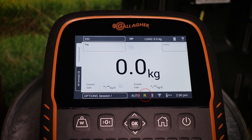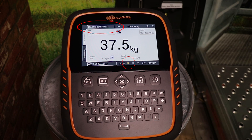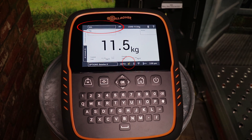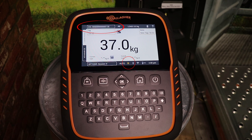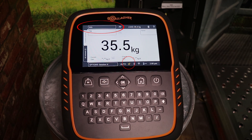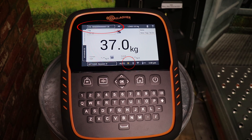This is the smart weighing mode in action. As soon as a weight is registered by the load bars, the weigh scale will turn the reader on and look for an EID tag. When an EID tag is found, the reader will turn itself back off to conserve battery, and the weigh scale will save the registered weight against the scanned EID number. When a new weight comes onto the load bars, the reader activates again and searches for the EID tag. This algorithm is designed to ensure the battery life of the weigh scale and reader is maximized.